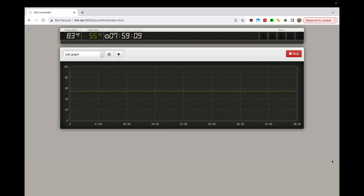I just plugged in the thermocouple. Here is the software I use — it's open source, and I have a profile that basically just graphs the temperature. It sets the temperature to something relatively low and then just keeps reading the values and graphs them. Apologies for those in metric — this is in Fahrenheit. I'm going to hold on to the thermocouple for a minute and see if the temperature goes up or down. The fact that it's reading 82 degrees right now is not promising — it's definitely not 82 degrees ambient right now. The reading is going down, so I'm pretty sure the leads are backwards. Let me swap them and see if we can get it going the other direction.